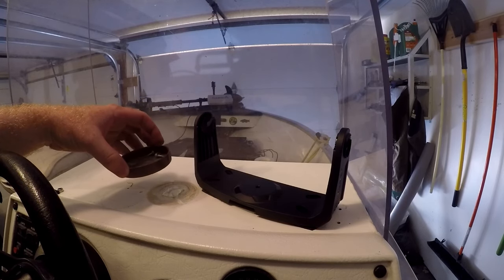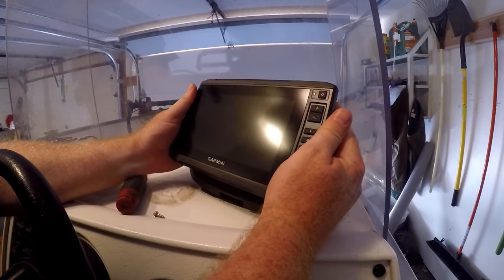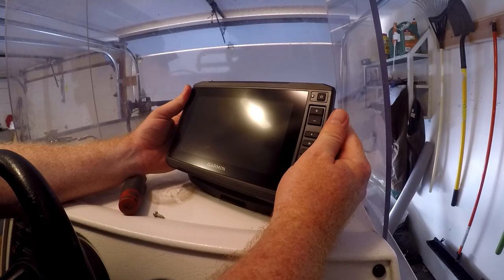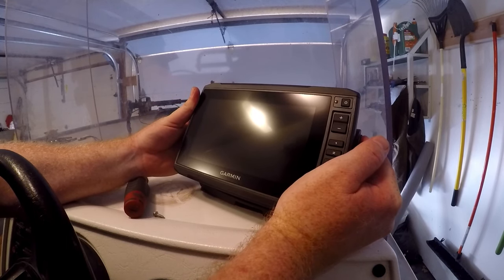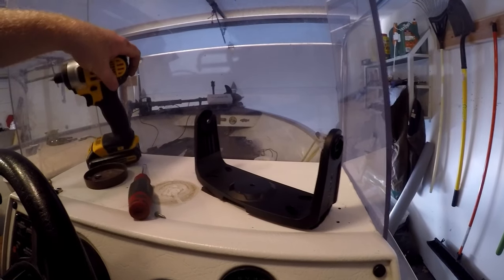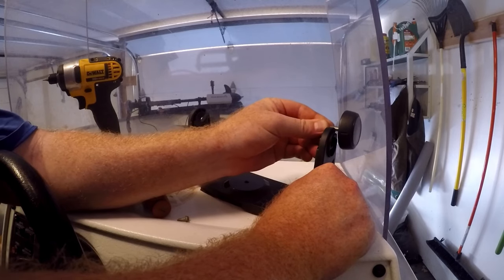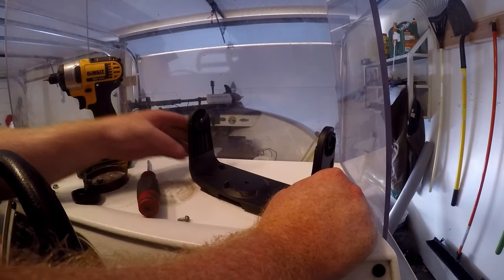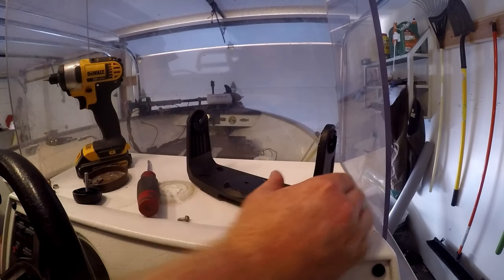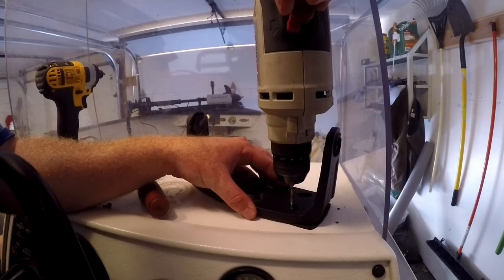This is my grandpa's old boat that I bought from him and he had this cup holder right here — it's kind of in the way so I had to peel it off. Do a temporary test fit where you want it. It's going to sit right on the old pad where the old transducer was, so that's where I'm going to keep it. If you have any obstructions make sure you give yourself enough room. Keep in mind that the unit slides in from the back. Be careful with your drill — make sure you don't over-drill into anything that might be below.